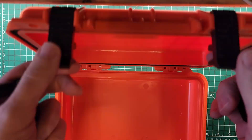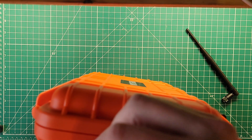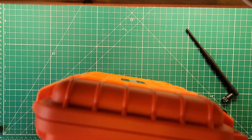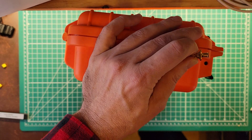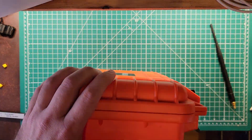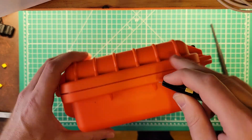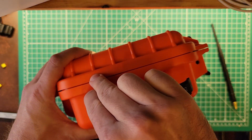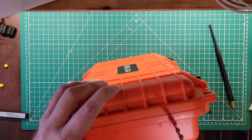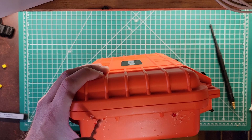Where do we put them? One on each side, two on the same side. Here I'm measuring off-camera so you guys can't see — just take my word for it, I'm actually measuring. You want to make sure that there's enough room for the antenna stub to go on there and not interfere with the side of the case. And then I got out my Stanley knife and gave myself a little pilot spot so the drill didn't walk all over. In hindsight I probably should have put some masking tape down or something, but I didn't.